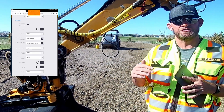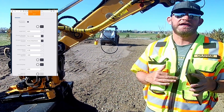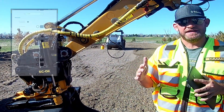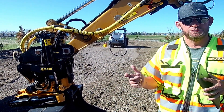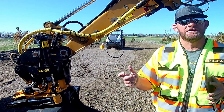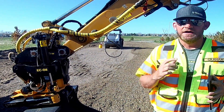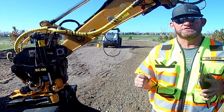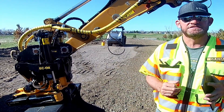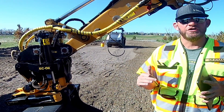It's important to keep in mind that once you start those measurements you cannot exit without saving. The first step is to zero the rotation of the tilt rotator — all these measurements are predicated on the position of the bucket. Once you start going through these menus you can't come back and revisit them, so have all your tools ready.